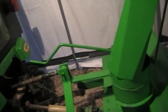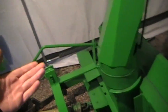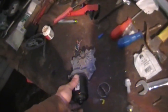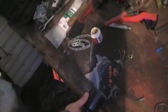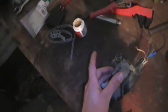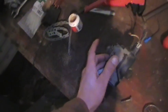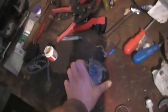What I did was I went to the scrapyard — if you watch my previous videos you'll have already seen this — but I picked up this window motor from the scrapyard, cost me I think 15 bucks. You can get the two-wire ones, that's just power — you just reverse polarity. But a lot of them have a gear instead of a nut, and you want the shaft so that you can weld this to that. This one's out of a '02 Chevy Malibu.